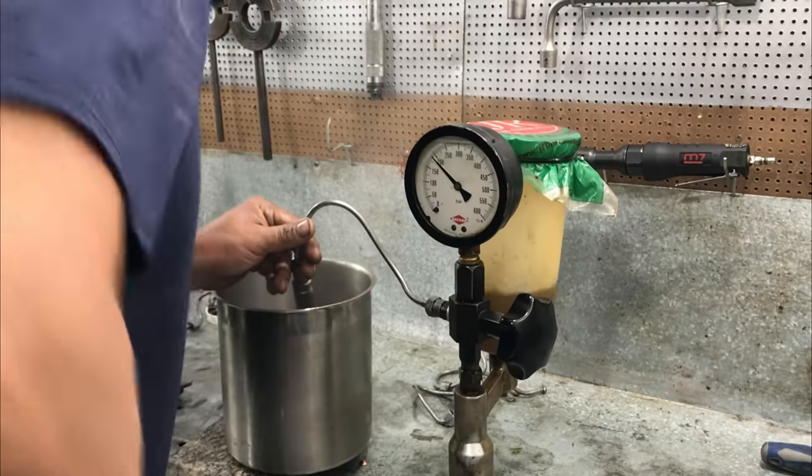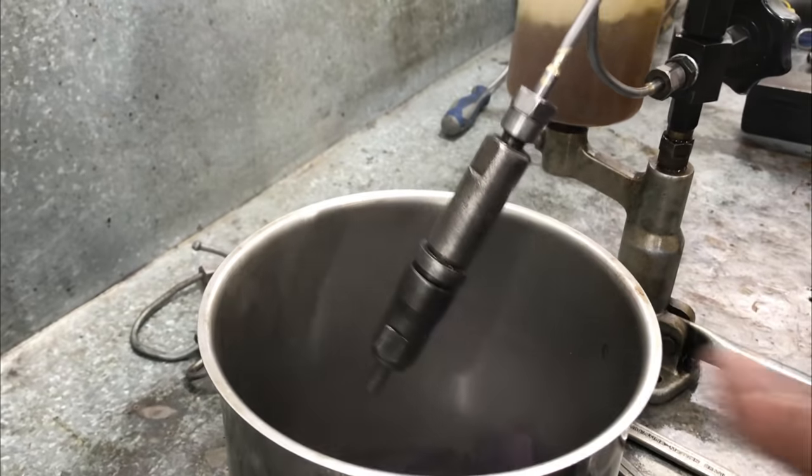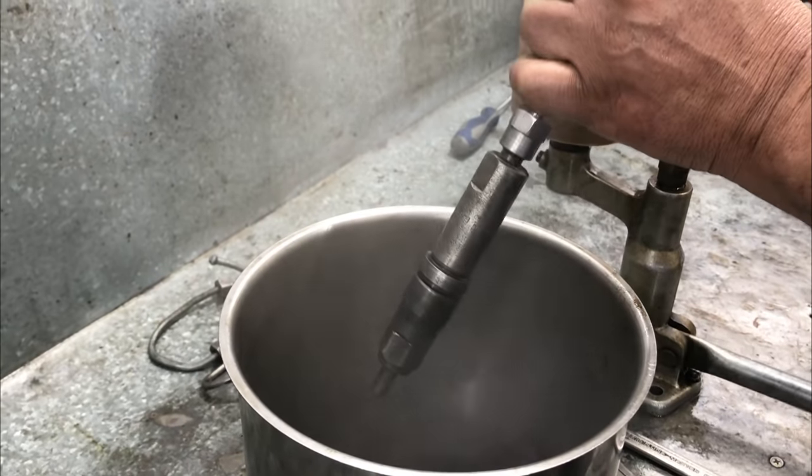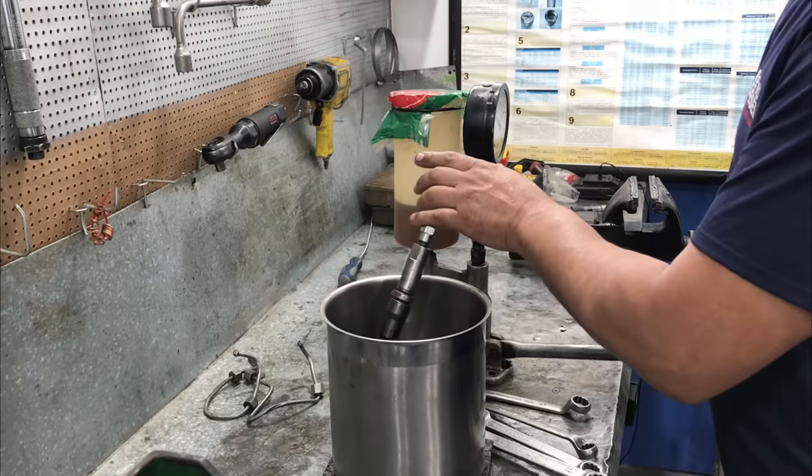All the pressure of every single one of them has to reach 200, and not just the number, but the behavior of how the four holes have to really squirt some water or oil. He set a couple already and they were all good except for one that, instead of going strong, was more like dripping, so we're gonna have a look at that one.